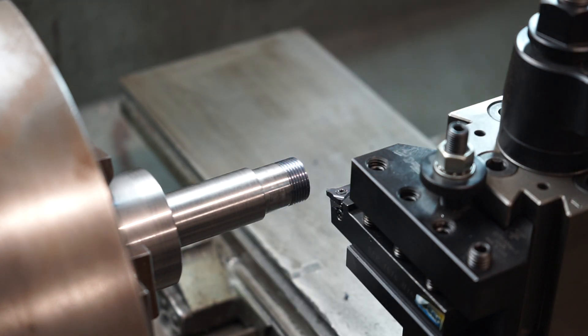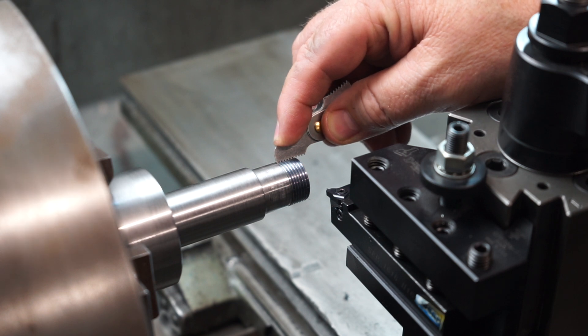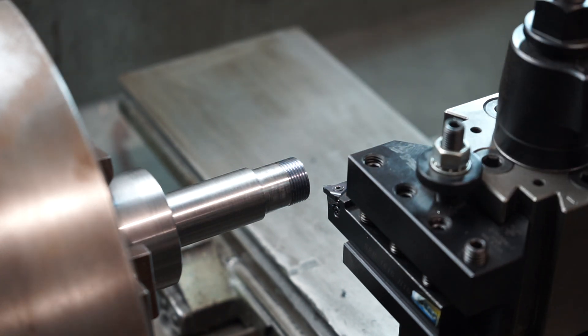The thread's coming along nicely. I'll drop in with my pitch gauge one more time — too late if it isn't right, the screw would be stuffed. Yep, like a finger in a glove — we'll keep going. I like to take five thou at a time and then do another clean-up pass.